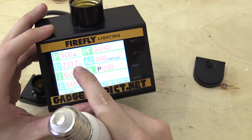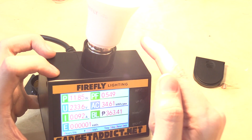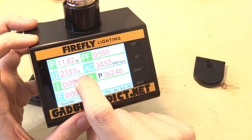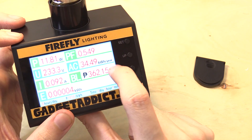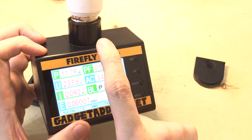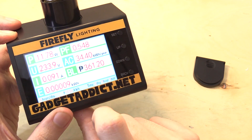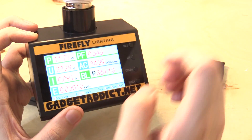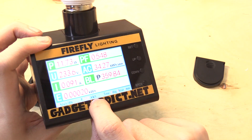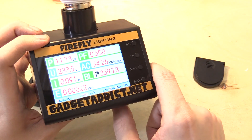When we first turn on the unit we'll see the voltage of the AC — 233.3 volts, fluctuating a little bit. We screw in our bulb and the lamp turns on, showing us how much power it's consuming: 11.83 watts. So we've got our power usage, voltage, current, power factor, and then how much it consumes in kilowatt hours per year and the cost to run it per year. I base this on the lamp running for 8 hours a day at an estimated cost of 10.5 pesos per kilowatt hour, 365 days a year, so that's roughly how much it would cost you.